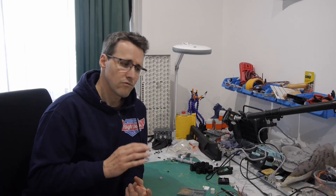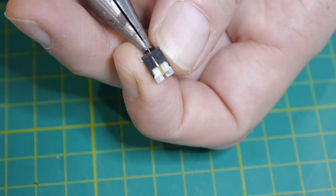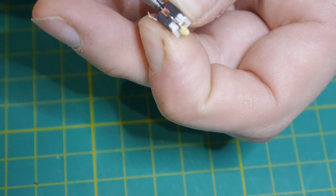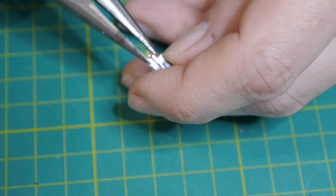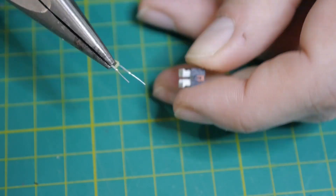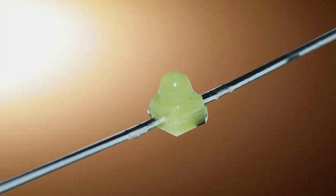Finally I made the decision that there is no other choice but to build them myself. You can relatively easily remove the LEDs of those tactile buttons — just wiggle a little bit with some tools you have lying around and then pull the LED out of the box. As a replacement you can use those 1.5 millimeter LEDs.